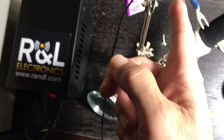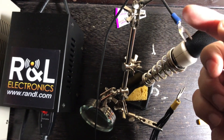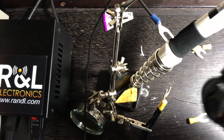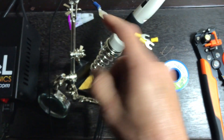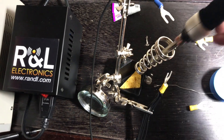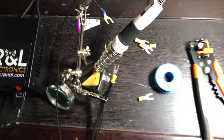Similarly, I did the same process with the elements. You can see the blue connector — I stripped the wire using my wire strippers, tinned the connection, and applied solder to reinforce it. So my elements are ready and my radials are ready. Let's go outside and start putting this antenna together.